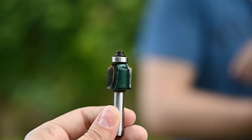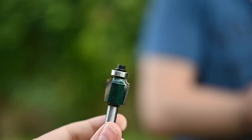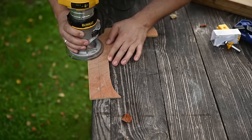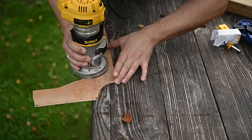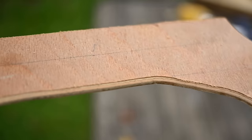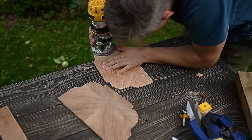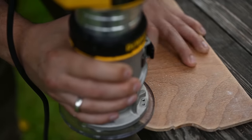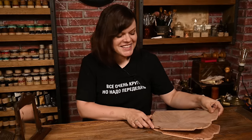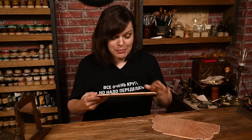On the reference picture, the edge of the tabletop is not just rounded but curvy, so a router is needed. We bought an ogee router bit to make a similar edge — the smallest curve I could find, intended for 9mm wood. Gary is the one doing this work since I don't want to spoil the parts. It looks great! Now let's work with the parts.